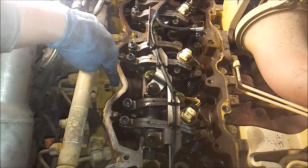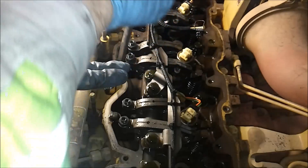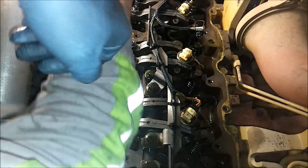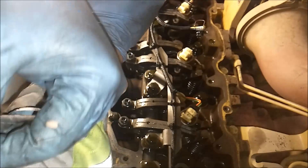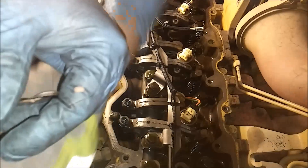So fuel line is off. Next thing you have to do is remove the quill tube nut. This is what presses the quill tube into the head and into the injector. These torque to about 50 foot-pounds, so they're a little tight on there. If you can get a larger ratchet, it usually works better than a wrench, but I wasn't going to take all the intake off just to get a ratchet on it. Sometimes that nut is super coated with paint - you might have to use a little bigger size wrench than you're used to on these Cats, because they really paint the heck out of them.